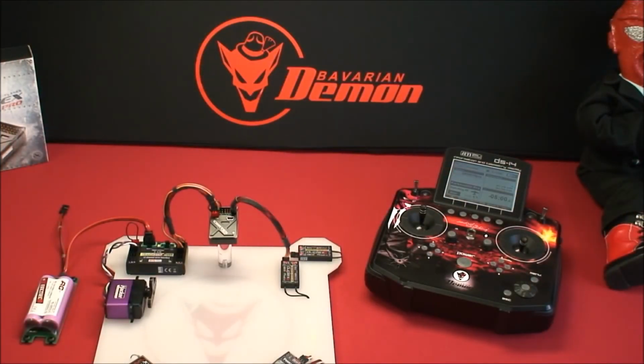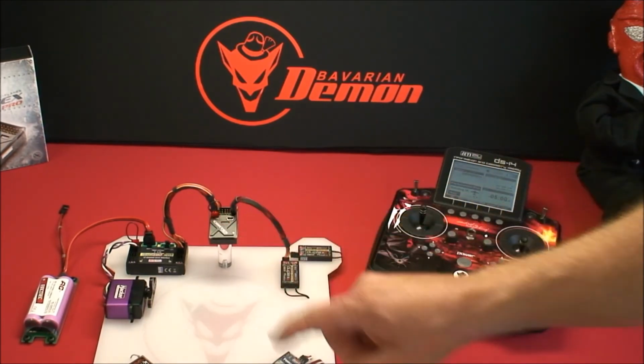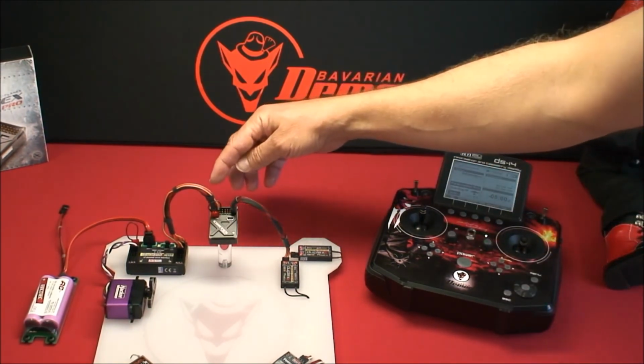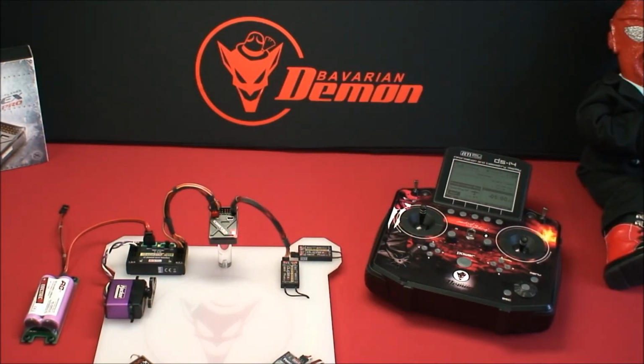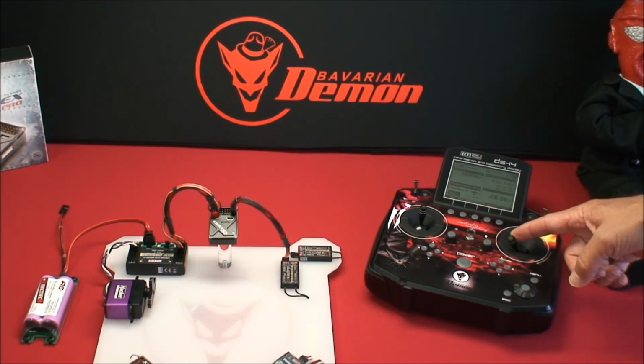and that's the whole input type teach-in sequence. Next we will teach the controls to the CORTEXpro. Make sure to have the jumper in place whilst the unit is turned off. So radio is turned on, we will now power the whole system with jumper in place, and this puts the CORTEXpro into programming mode. It will give us some indications by green LED blinks as well as servo bumps. We're waiting for the first double green blink and the servo to bump once. There we go. Aileron right and hold. Single blink, single bump, aileron left and hold.